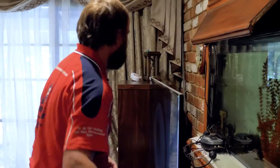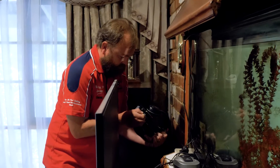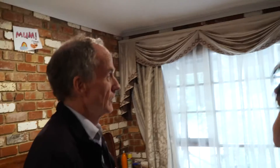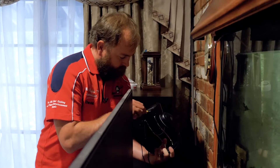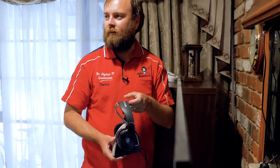The problem with these headsets is they're actually operating on a 900 MHz frequency, and I think they're on the same frequency. So what we can do is try turning one off. If we unplug the power on one of them and you put that on - yeah, that sounds alright. So if I plug the power back into this one, does that squeal come back? Yeah, that's it. So that's the problem - they're on the same frequency. Exactly, so you can't have two on the same frequency. Well you can, it just doesn't make a very good sound.